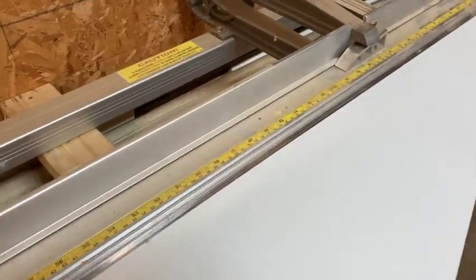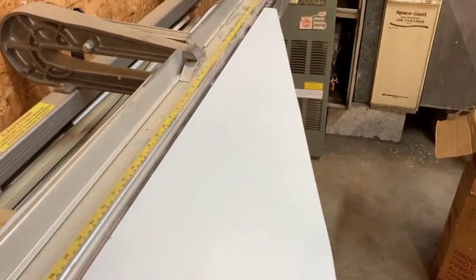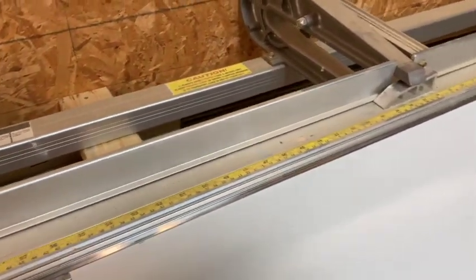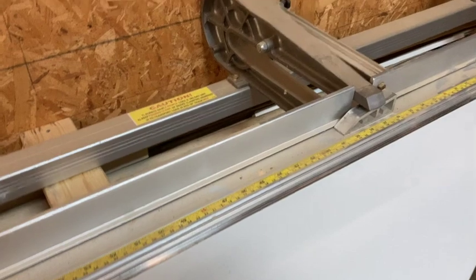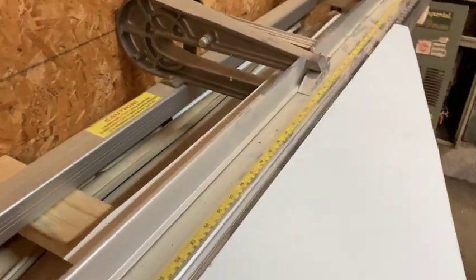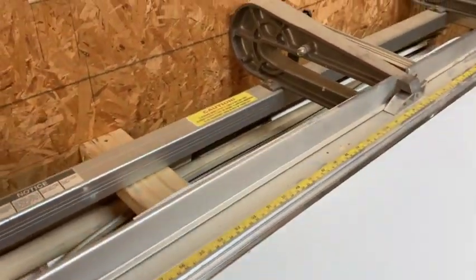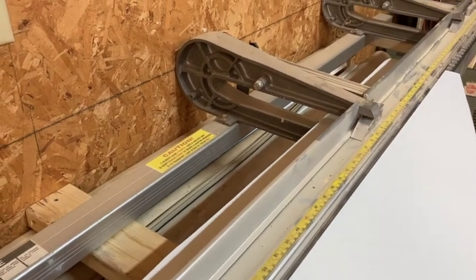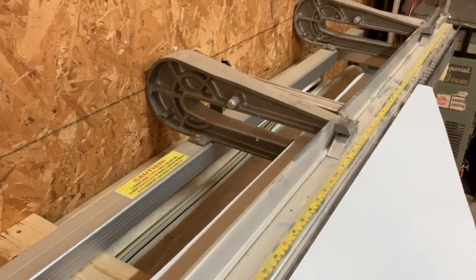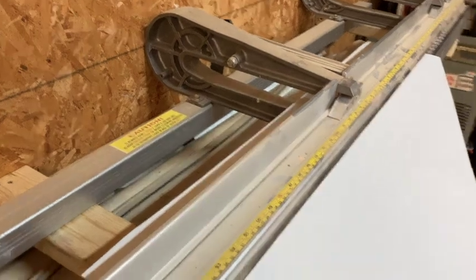I'm also going to bend a flashing that's going to go under the door and lap down over the siding. These are old rental houses that we're working on, and tend to get a lot of wear and tear down there, so I always put a flashing down under the door too. And this is going to be simply a 4-inch piece that goes under the door with a 1-inch bend that will go down over the siding and help water run out over the top of the siding instead of going in behind it.